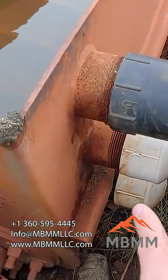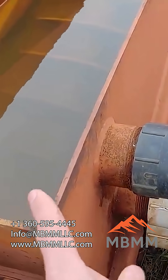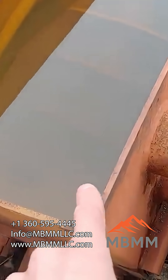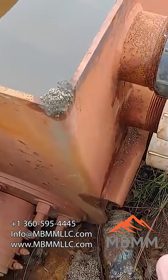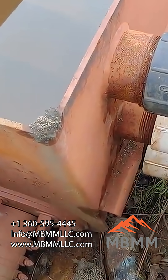On the very lowest port here, the basin is very small, so only the largest particles with the fastest settling velocity can settle down in this screw. If you're talking about quartz, you're probably looking at somewhere between 75 and 100 mesh settling out at that lower point. Everything finer than that gets washed out into the settling pond.